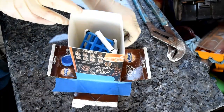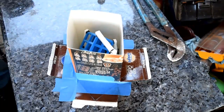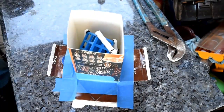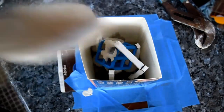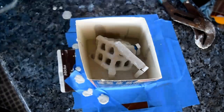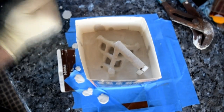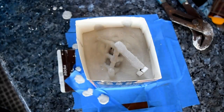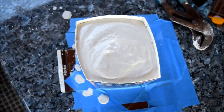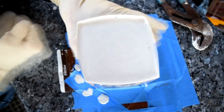You also don't want a little gap that the plaster will fill, because then you have to dig it out to find the sprue. I ended up having that problem on this mold for one of the risers — it wasn't a big deal, I could just dig it out in a couple of minutes, but keep that in mind. The next step was to take an old carton, tape it around the mold, and fill it with a 50-50 plaster of Paris and silica sand mix.